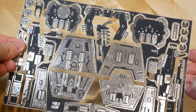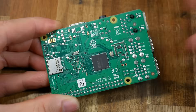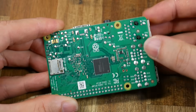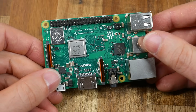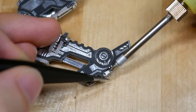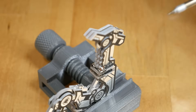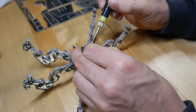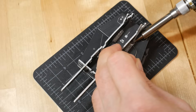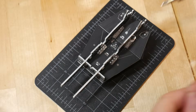In case you're wondering exactly how these kits work, here's an explanation. All of the pieces of the kit are made from PCB — Printed Circuit Board — which is the basis of most consumer electronics. It has layers of conductive copper on fiberglass sheet. When constructing these kits, not only do we solder electronic components like on a regular PCB, but we also solder individual pieces together to make sub-assemblies, and then those sub-assemblies are soldered together to form the overall structure. There's no glue or traditional fasteners like nuts and bolts required, and by the time the kit is complete, the person making it will have had a lot of practice soldering in different styles.